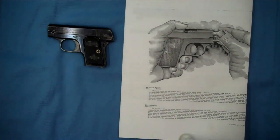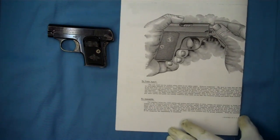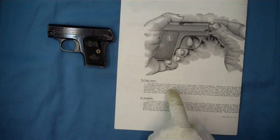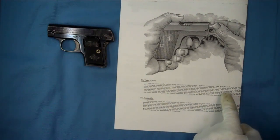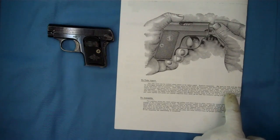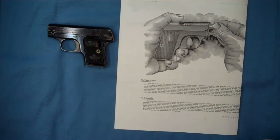The back page shows an illustration of how to hold the pistol when you field strip it. It says: the arm must not be cocked when about to be taken apart. Remove magazine. Be sure no cartridges remain in the chamber. Grasp pistol in left hand as illustrated and draw back the slide until within 1/16th of an inch from the end of the receiver. With right hand, give barrel one quarter turn to the right. Care should be taken to see that the slide lock safety is not pushed upward, as this will release the slide lock safety plunger and spring, causing them to fly out and become lost.